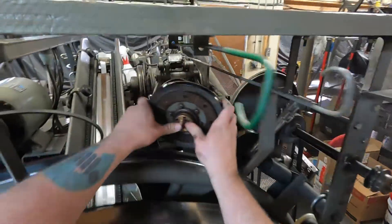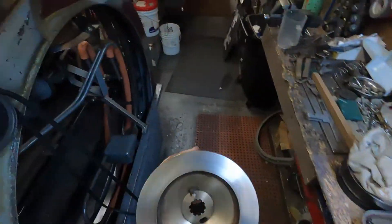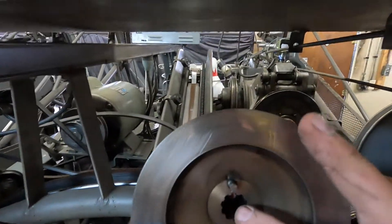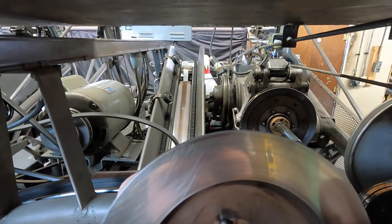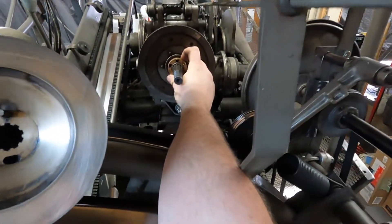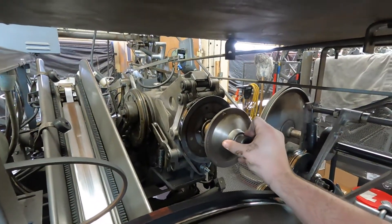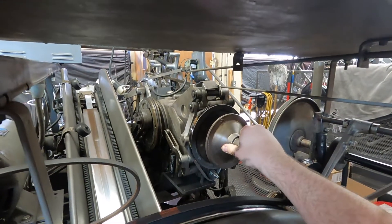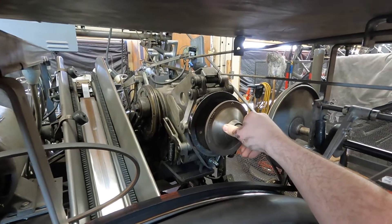With these cleaned up and inspected, one other thing I like to do when putting this back together is look where this pin is. As you can see, this pin is basically right there on a top groove, so turn your hole to a top groove on here. When you put it on you can try to get it on the first try, but more likely than not it's not going to be the first try.